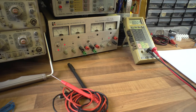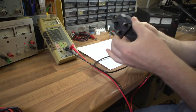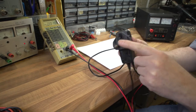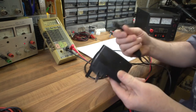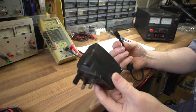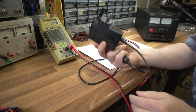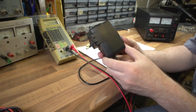Here's a phone charger - we've all got one of these lying around. You've got your three-pin 240 volt input with live and neutral - this one doesn't have an earth, that's just a plastic stub. On the end you've got a USB plug to charge your phone, or you can plug it into small development boards or use it in your own projects. It'll give you five volts. That's a switch mode supply inside, which is why they can make them so small.